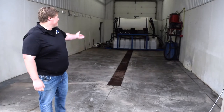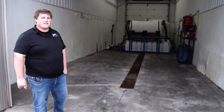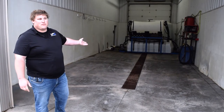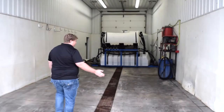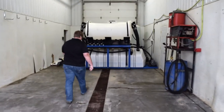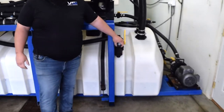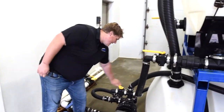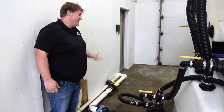This is the wash bay — it gives some perspective on how we're set up. We are a little spoiled, and obviously not everyone has a wash bay, but this is our biggest brine maker from VSI. Guys open the overhead door, back their truck right up to the brine maker, hook up the filtered fill line with cam locks, go over and turn on the pump, open the valve, open the fill line, fill the truck, and monitor volume on the flow meters.